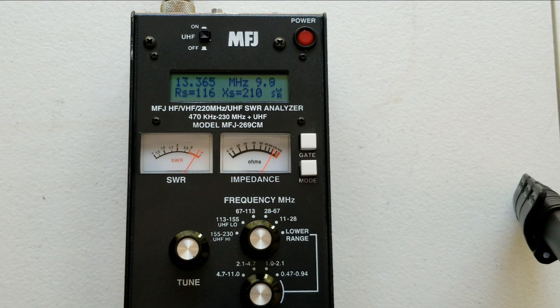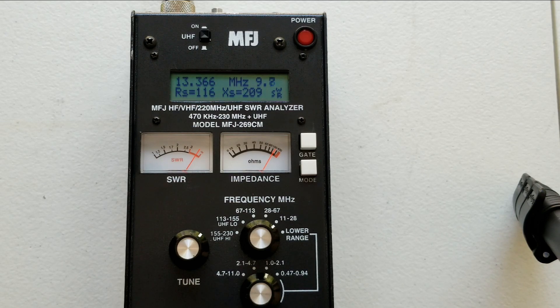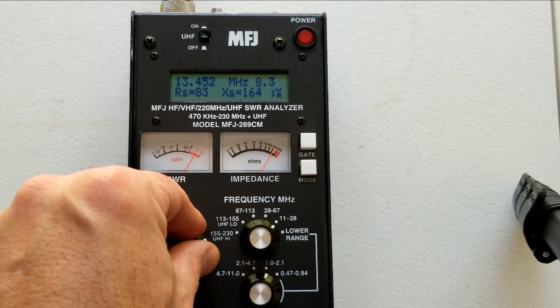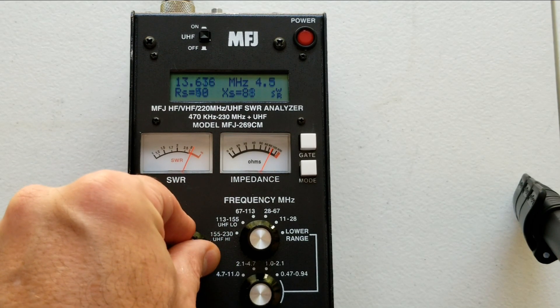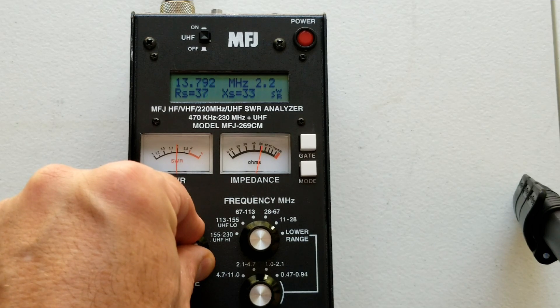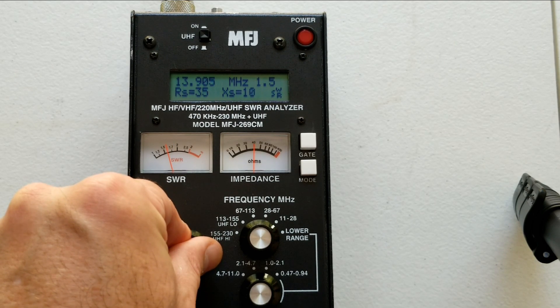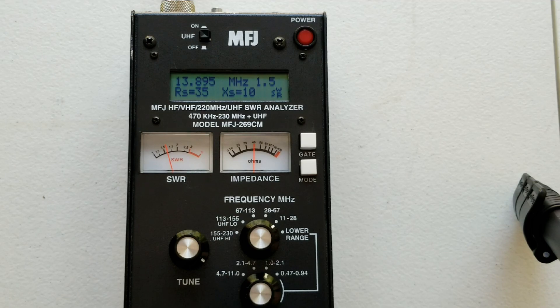All righty. I've moved the two stingers in on the two hamsticks on the Octopus antenna. Notice that I've got high SWR now. Earlier I had 1.2, so let's hopefully go up the band and see if that SWR starts to come down just by moving those stingers on the hamsticks. It's coming down — let's see where we come in at. Started bouncing back up, let's go back the other way a little bit. About right there: 1.5, but I'm still too low on the band. I'm closer to where I need to be at 14.225, but not where I need to be. So I need to make one more adjustment to those stingers.